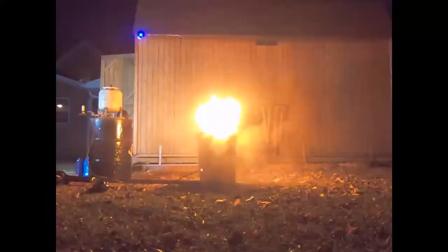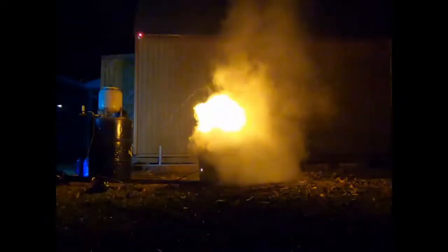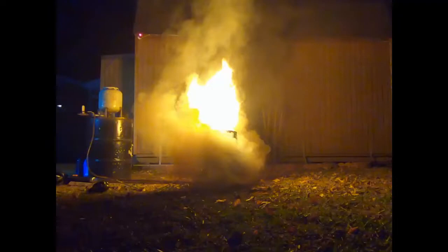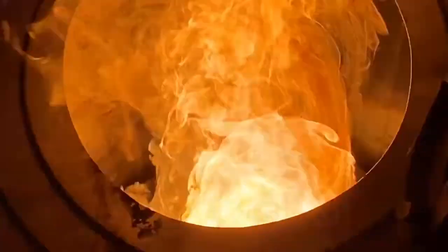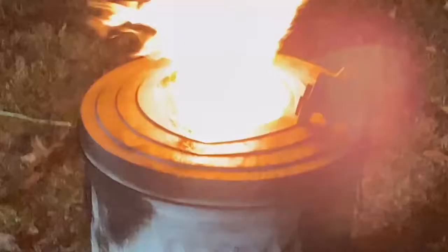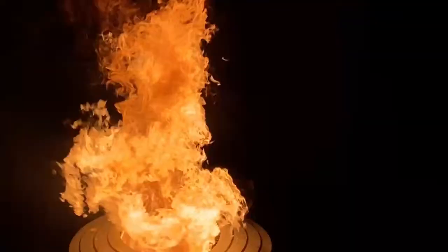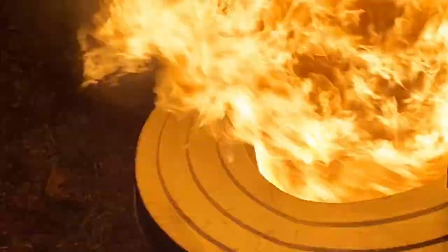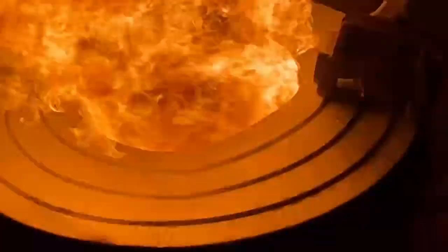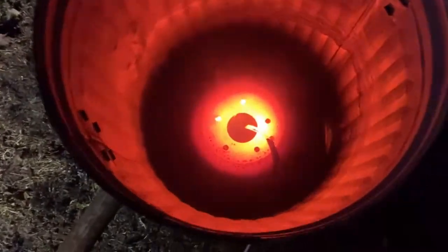That's sitting on top of a fuel tray, and what we can see here is a pressure-up event. The size of that cyclone fire is pretty important — you see here we're about to blow the lid off of this thing. The reason why we don't want to do a standard setup: if we were running at that kind of pressure, the fuel will not flow into the combustion chamber without a pump. Because we want to run without a fuel pump, we've got to keep this cyclone burning just the way we see it so there's no pressure inside the combustion chamber, otherwise the fuel won't pump right and you'll get pulsation. The reason we achieved what I said couldn't happen is because a reservoir of unburnt fuel had built up in the fuel tray, enabling a flash combustion event. The size of that discharge port is what creates the size of the vortex.